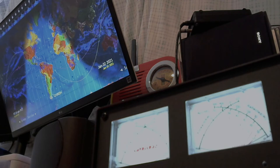Ham radio is about learning. There are three L's I use, and I think it was used once in the channel, LLL. How I look at this when I'm going to work Grayline or do DX is look, learn, then listen, okay? First thing you do is you look at propagation. You look at the forecast from not only your area but from other areas in the world. Check their MUFs. There's maps out there where you can see MUFs from around the world. That's number one. The second thing is learn it.